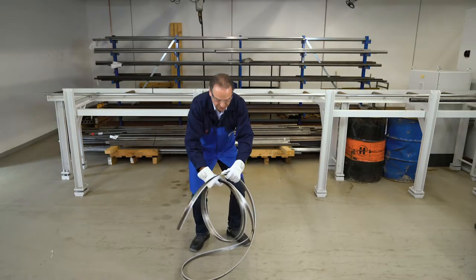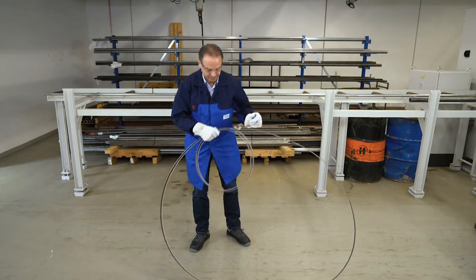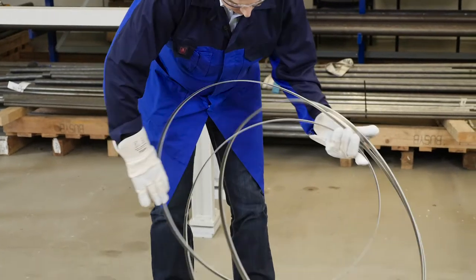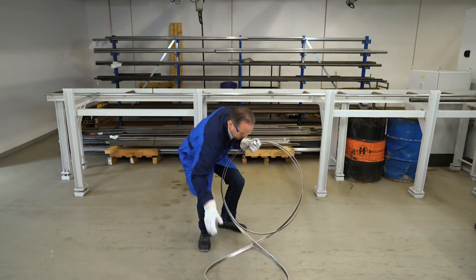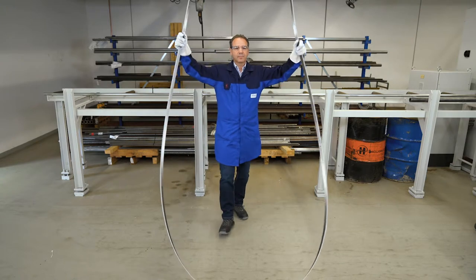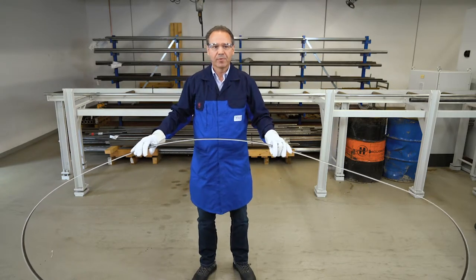You have to hold the other three loops firmly. Open the bandsaw blade. And wind the coils up to roughly the same size. Now, take the loop which the blade opens automatically with. The blade has been opened properly and safely.